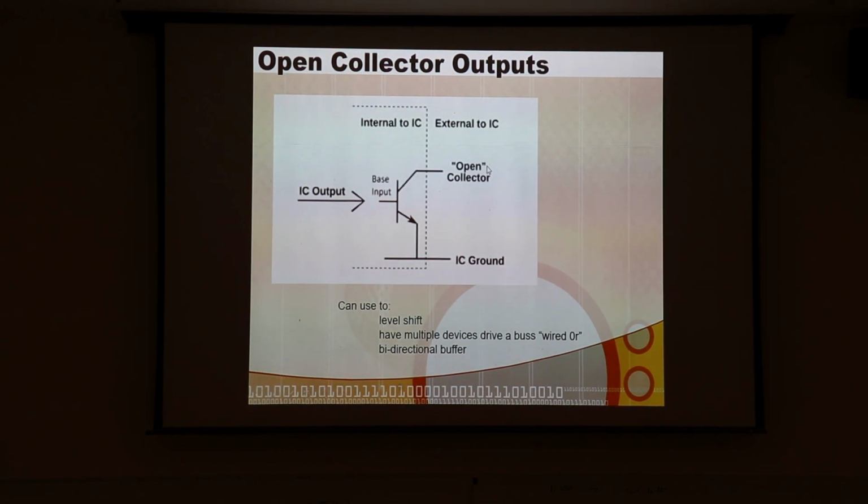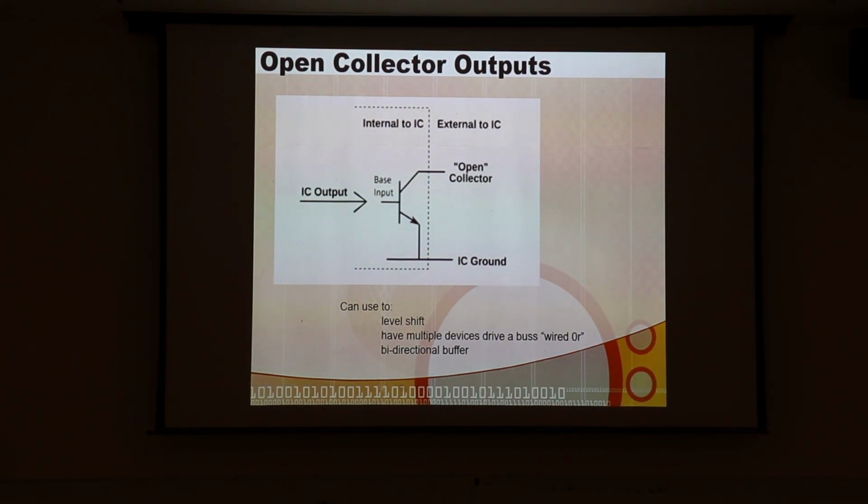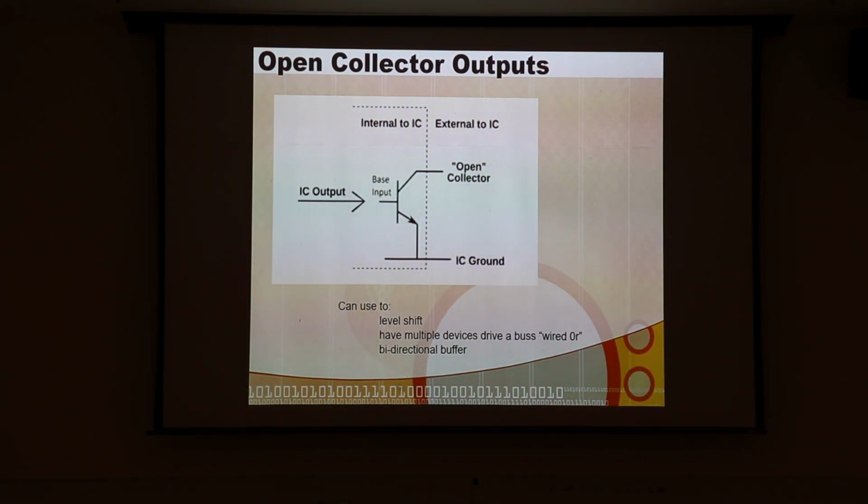And so anyway, what's nice about the open collector is it gives you the ability to hang a whole bunch of peripheral devices on the same bus. Since all the devices you put on this bus are open collectors, when they want to listen, they're always listening on the bus, okay? When they want to assert information on the bus, they do it by pulling the bus low or releasing the bus and letting it get pulled high by the pull-up resistors. So none of the devices on the bus ever drive the bus high.